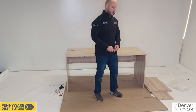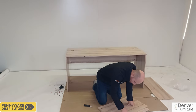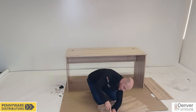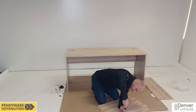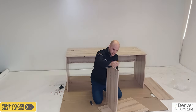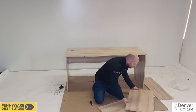Right side mounting. Let's get back to the two panels we set aside at the very start, beginning with the panel that was at the top — that will be the side foot panel. Insert two cams at the top. The next part is very important. Carefully look at step one of the right side mounting section. This is for the side foot. Only insert two dowels and screw in two steel pins into the holes matching the illustration. Lift the panel and insert two small plastic feet on the opposite side of the cams. Set this panel aside.